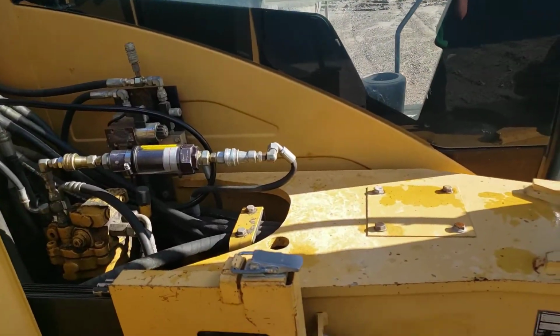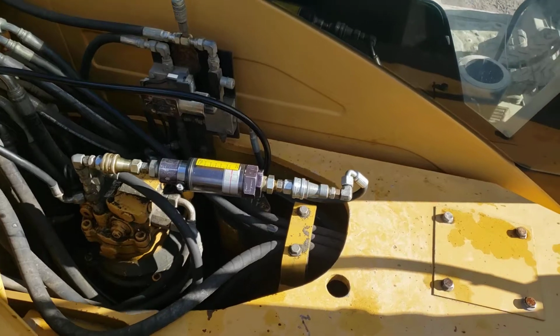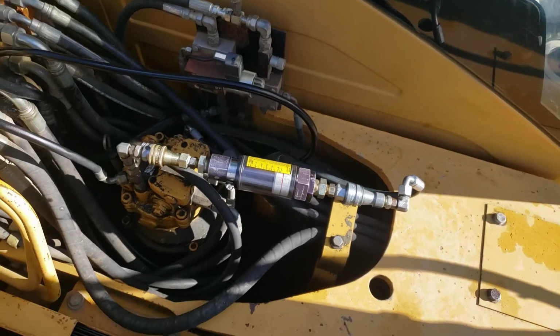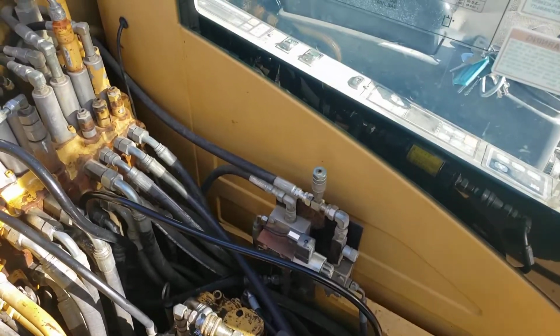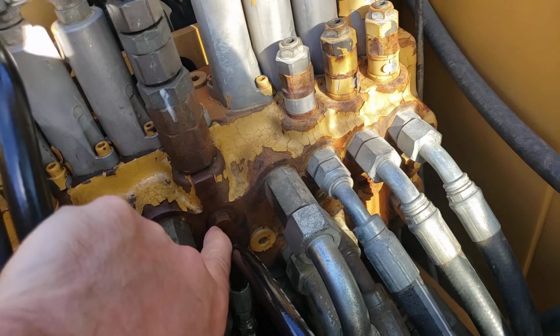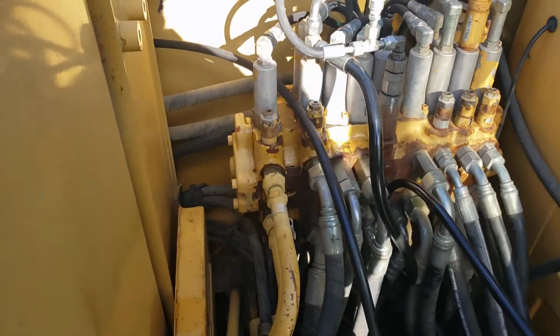So this time and the previous time when we did have a travel power issue, this machine's traveling fine now, but at that time we found the same results as we're finding now. It wasn't in fact a travel motor issue at all. You're probably wondering what was causing the travel power problem. The issue was actually the seats where the main relief check valves go.